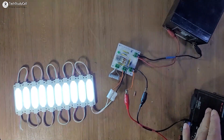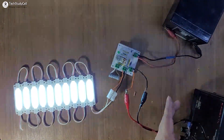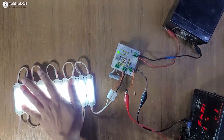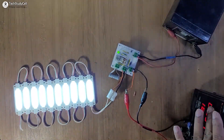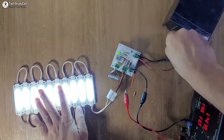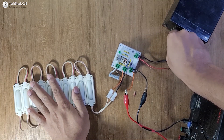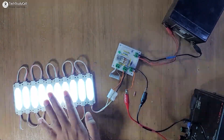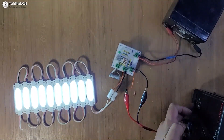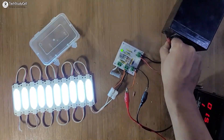The DC supply is not on, so this LED is glowing from the battery. Now let me turn on the supply. As soon as I turn on the DC supply, the green LED turns on and the LED is now getting supply from the DC supply. If I disconnect the battery, you can see the LEDs are still on. Now let me turn off the supply — as the battery is not connected, the LED turns off. If I connect the battery again, you can see the LED turns on again, although the DC supply is off. Now let me turn on the supply — it is again taking supply from the DC supply.